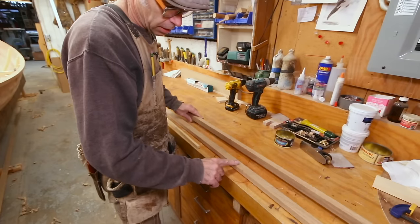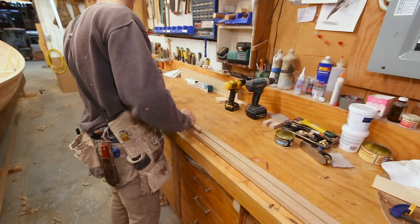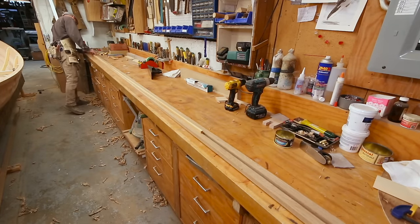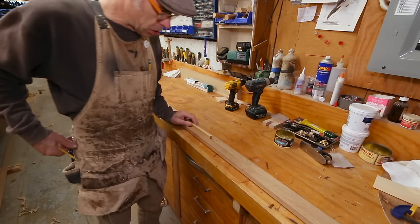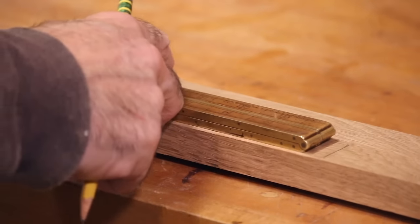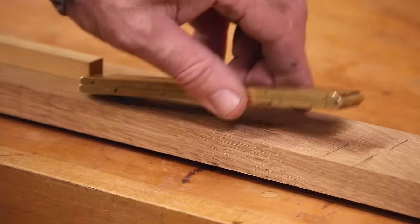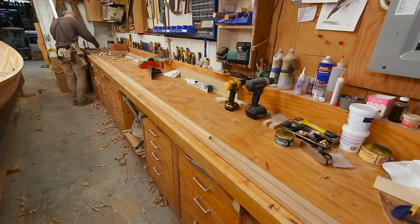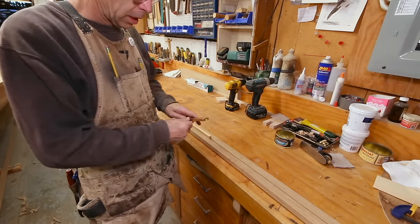So over here I got some ugly, knotty stuff. Leave a couple inches at the other end for checks or for snipe, and I come down here. I think I can get away with just cutting out just short of the knotty stuff, and that'll be good. Right there, the other end. We'll lose an inch off the other end. That'll be perfect, okay.